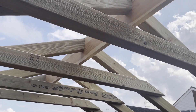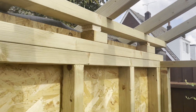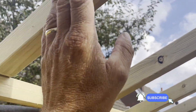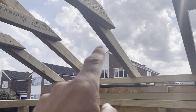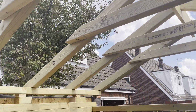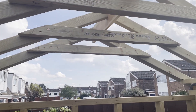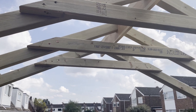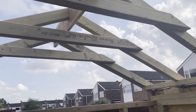I've got a 6x1 for a ridge board across the top there, and what I'm now about to do is use this 11mm OSB board. I'm going to screw a piece across here on the slope of the rafters, then on the flat piece, and then again on the other slope on the other side. That will act as diagonal bracing and should keep the whole roof square and stop it from wringing and twisting, so that it runs out nicely on the tracks.